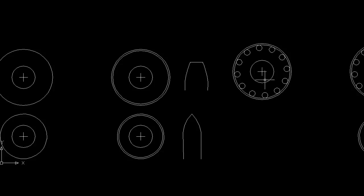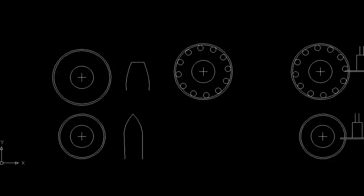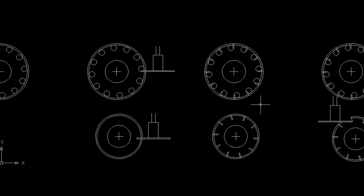The next move I only do on the Eureka tool, and that's I drill these 1/8 inch holes around here. And there's 12 of them because it's going to be 12 teeth on this cutter, whereas on Robert Porter's cutter there's only 10. The next part is I use a slitting saw. On the Eureka tool, I'm right on the center line, which cuts the very bottom of the 1/8 inch holes that I just drilled. With Robert Porter's method, we top off here, bring it down to the center line, and then we do some mathematical calculations to get a 7 or an 8 degree radial rake into the cut.